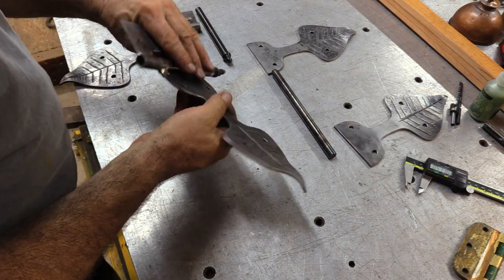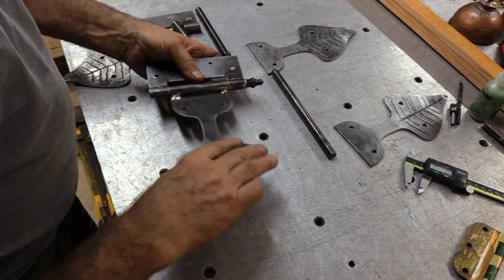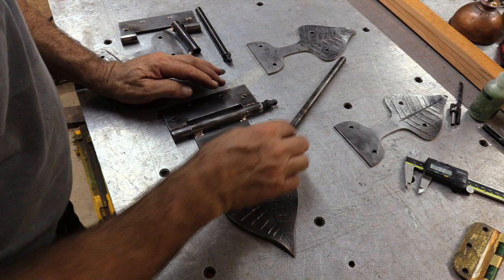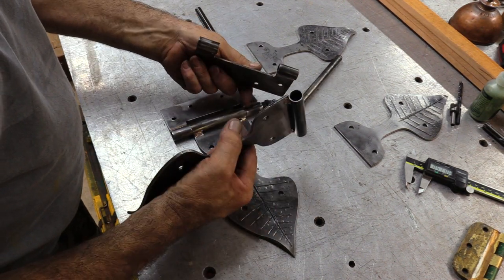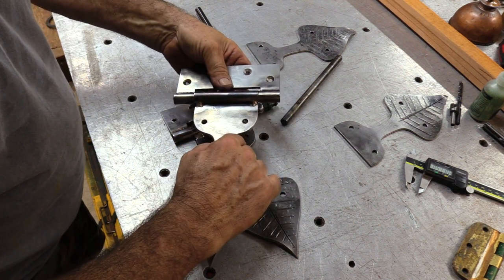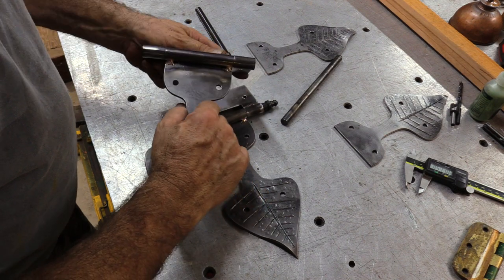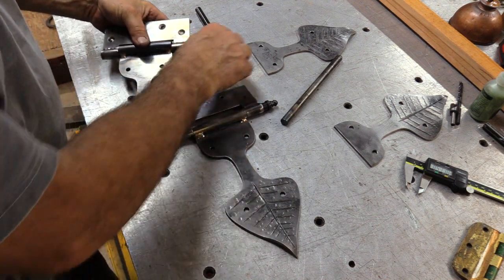And then just a couple little brazes on this side to give it a little bit more shear strength there. It doesn't need much. I did not have to weld that all the way. So that's how I did it, and then I knocked out the pin. Then I took them individually, the pins knocked out. I ran the reamer through them, okay, so that they're nice. But these fit absolutely perfect in here by doing them the way I did it. Didn't have to do anything adjustment wise. And reaming them out makes it nice and, you know, square if they got a little deformed or anything.